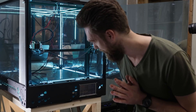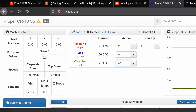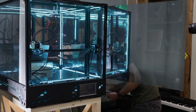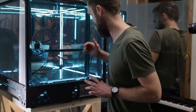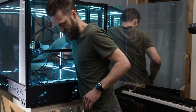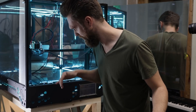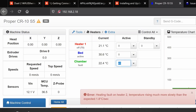And now the strip heater together with two fans - so we should hear it when it is going to be enabled. It's enabled. It is heating up. I get an error, the same error I got before. But I can check if it's a bit warm - yes, there is warmth coming from there. Now I'm going to fix the end stops and I have to remove that Z-motor and get rid of this stupid error, because 1.8 degrees per second is a bit fast for a chamber.